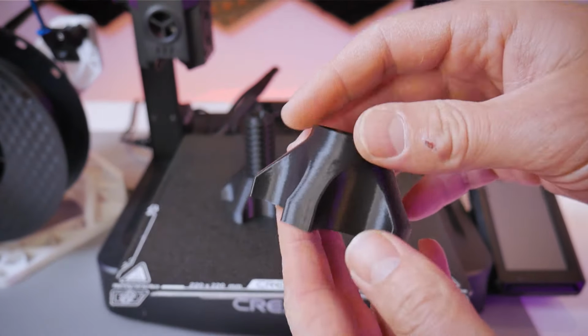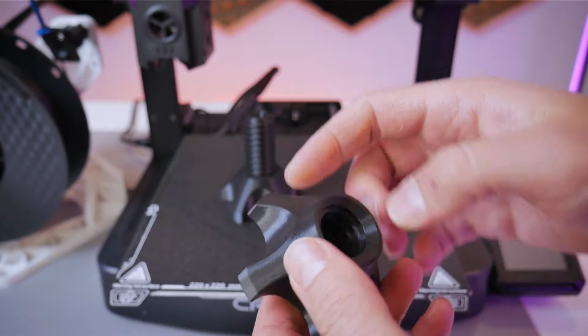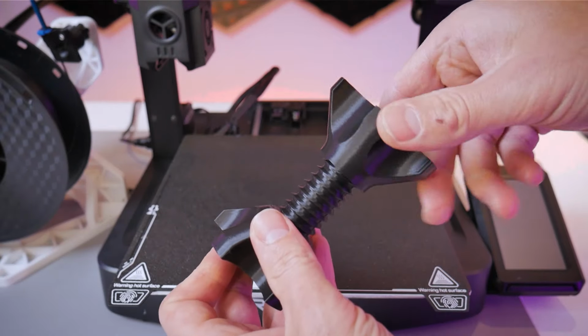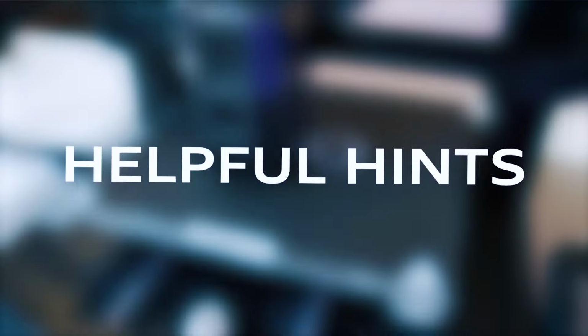Personally, I think these parts came out looking even nicer than the Creality White Hyper PLA, and truthfully this is just some off-brand regular black PLA, nothing special here. My only complaint was that the first layer maybe just wasn't quite squished enough, but the two parts fit together and there were no serious blemishes or artifacts on them.